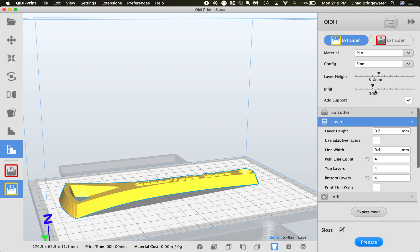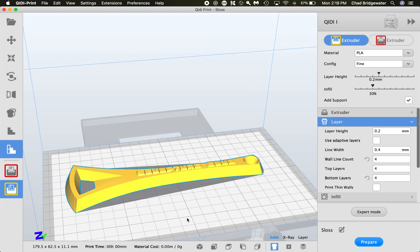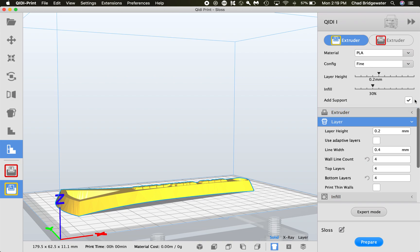For infill, it depends on what you're printing. If it's going to sit on a shelf, you could go hollow — 10% or 5%. Remember, these are not solid models unless you choose 100% infill, which I do not suggest unless you have a specific reason. Usually it's a waste of filament. For something functional I do 30–35%, sometimes as low as 20% or as high as 70%. For Add Supports — if you turn it on here, it's not going to add them because there's really nowhere to put them, so you can safely keep it on.